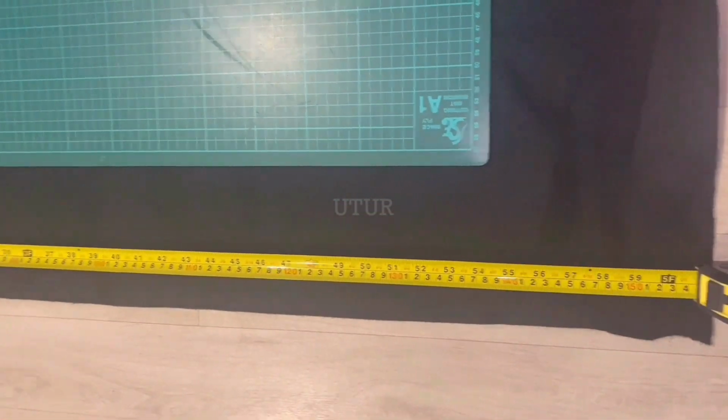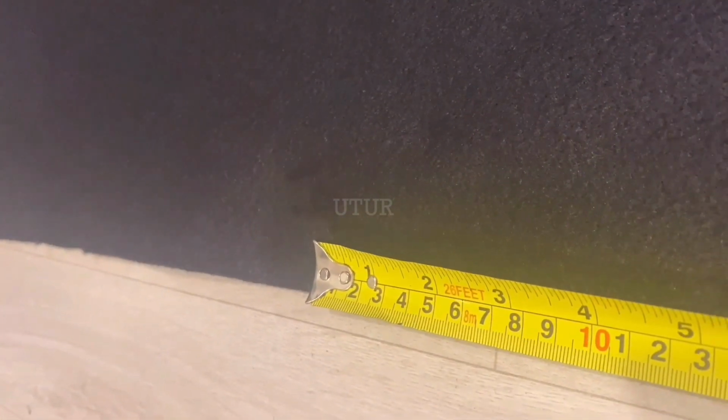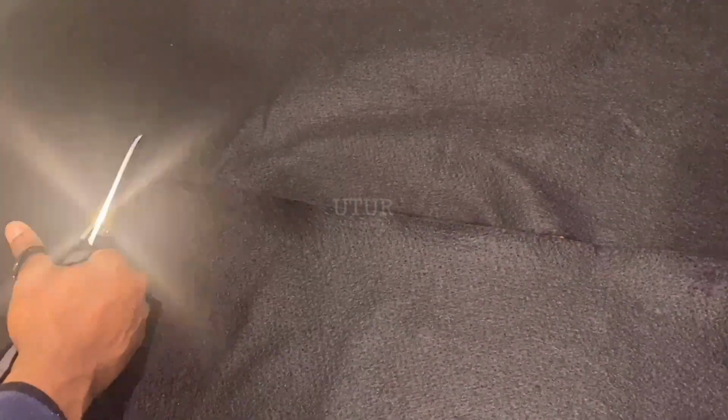The first step of the sealing off process would be to cut the acoustic dampening fabric in squares or rectangles. Suffice to say, first cut the fabric length with respect to the perimeter of the housing frame, and then subsequently cut the fabric breadth with respect to the height of the housing frame. This will ensure that the cut fabric secures or seals off the entire housing pillar structure. You could use a permanent marker and a cutting mat so that your cutting line is quite visible on the fabric, but make sure that you're marking the fabric on the underside or the back of the dampening fabric. And as you can see, I'm running the scissors through the cutting line, and it's quite a cost-effective way of saving on material.